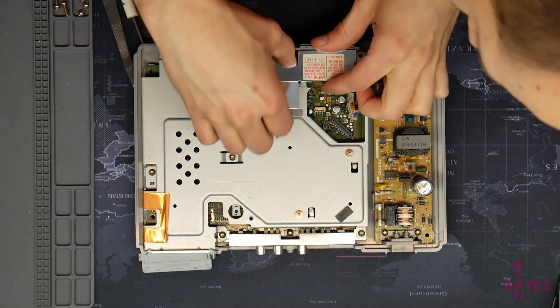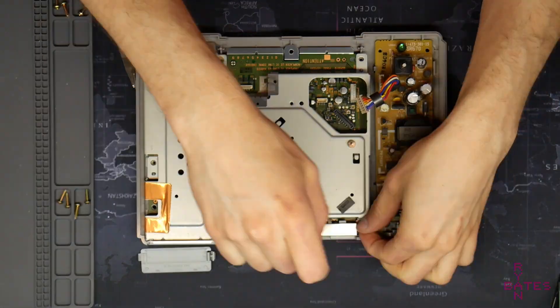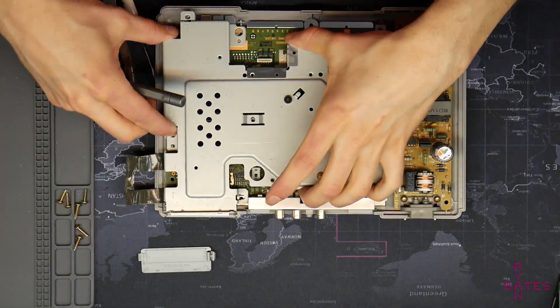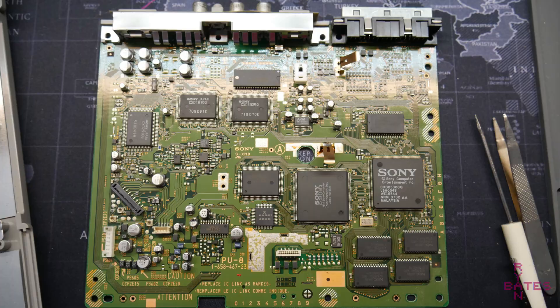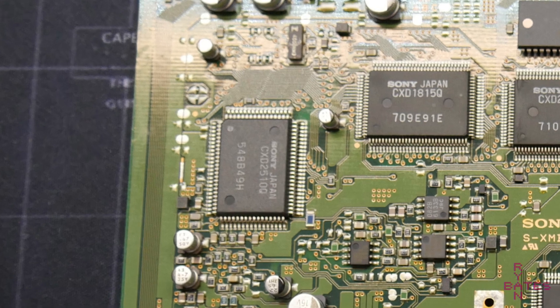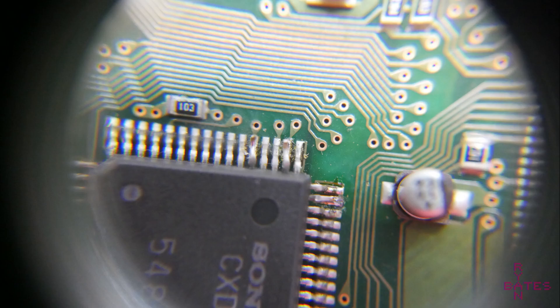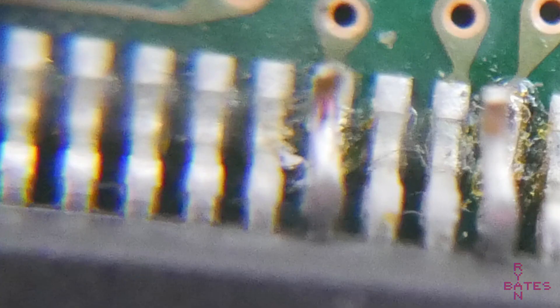I am not going to do a full tutorial on how to install the XStation — the documentation is very sufficient — but here's what you can expect. The hard part comes first after disassembly: we have to lift a few pins from the CXD2510Q. This was somewhat stressful because it's very small package work. If you don't have a scope to enlarge your view, iSquints will hopefully get you there. I used a fine soldering iron tip and an exacto knife to lift the required pins. You absolutely need some kind of magnification to check your work — I used a 10X magnifier. I did have some residual solder touching an adjacent pin the first time, which meant I had to disassemble twice.